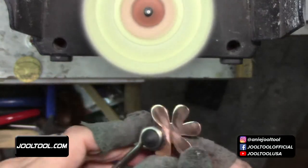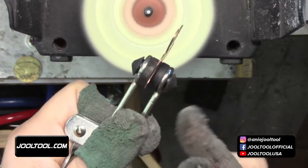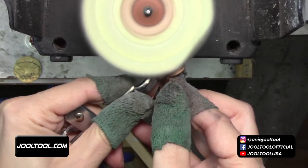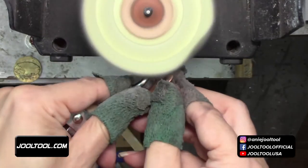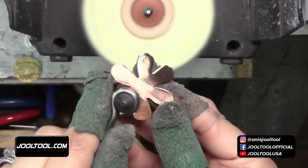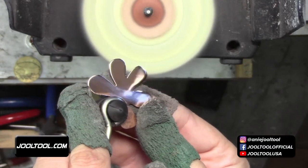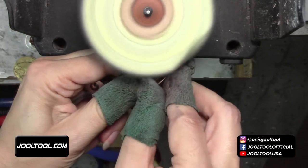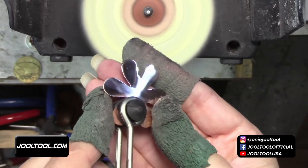It's quite nice. So, you know, you don't want to rely 1,000% and just do it like this. I always give whatever it's pinching a support. You know what I mean? So there we go. If you use that, you guys see how it doesn't leave any black marks at a lower speed? Just hold it there and kind of do it slow. Do you guys see that polish right there? You can just keep going. I only did the two parts, but if you just hold it there light at a slow speed, you'll really get a super high polish.